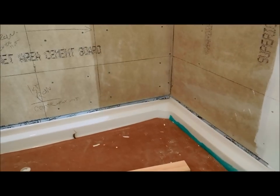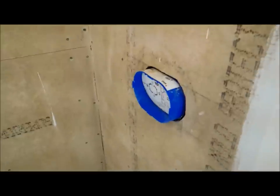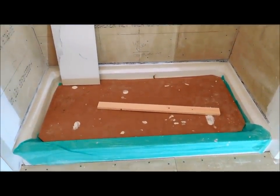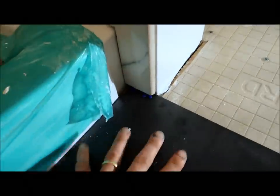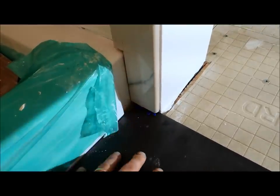So we've marked our layout. I want to be careful — I have the shower valve up here and I want to try to avoid having this valve end in the middle of the tile, because that's a pain to cut out. I have it laid out so that this ends up on a corner of four different tiles, so that'll work out alright. I want to set the end of my tile run first, just so I know where I'm ending up. I've cut around the tub where I need to on this trim tile. Make sure you put the floor tile down — even though the floor is not done yet — and add a spacer between the wall tile and the floor tile, because you want the wall tile to go on top of the floor tile if at all possible.